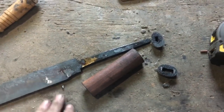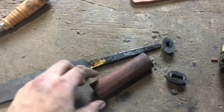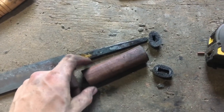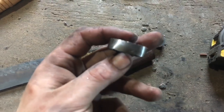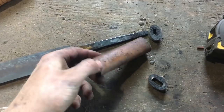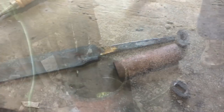Here we are after grinding the handle. I've already disassembled — all I did was put it up in the vise and tap the bottom of the tang with a hammer. The super glue worked like a charm. Everything is sanded to its final shape pretty much. I'm just going to throw the fittings back in the fire, blacken them real good, and hand sand the handle to its final grit, then move on with heat treating and finish grinding the blade.